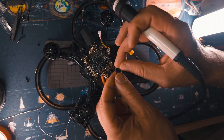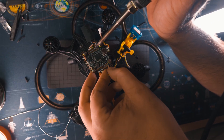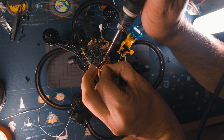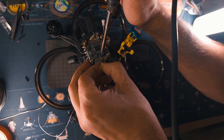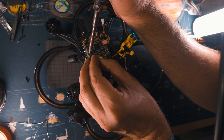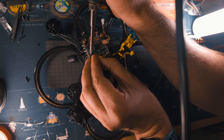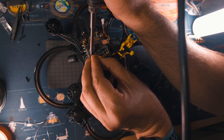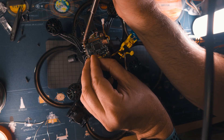Now it's time to wire up the Meteor LED board to the chassis. Here we have the positive wire, which we connect to a battery pin. I forgot to show where I soldered the RX and TX wires to the UART port. The yellow cable is for the boot pin, which is pretty small on this specific board.